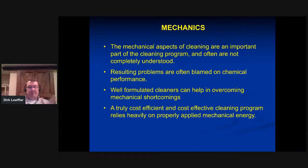Mechanics — extremely important. You cannot remove any deposits without fluid mechanics, period. It doesn't matter how much chemical you throw at it — it will not come off the equipment unless you have proper fluid mechanics in place. Most chemical suppliers don't really understand this because they're chemical guys, not engineers — they don't deal with fluid mechanics. It's important that you have a basic understanding of fluid mechanics and what to watch out for. The more your fluid mechanics are dialed in, the less time and less money you'll spend on cleaning. Good fluid mechanics can make a huge difference in what concentrations and how long you have to run cycles.